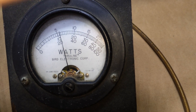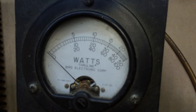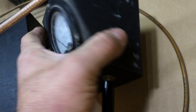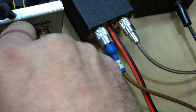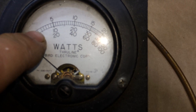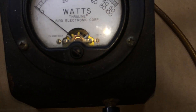Turning the driver off to see what the radio does on its own. About 300 watts with just the radio on average power. Then turning the driver back on — one pill driving two. Now switching to the 5000-watt slug — I know the reading will be way down on that scale for this power level, but let's just check. It should be reading around 500 on that slug. Keying — there it is.